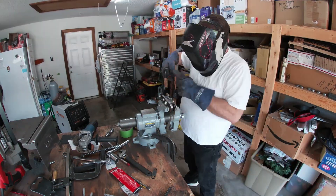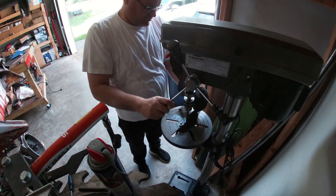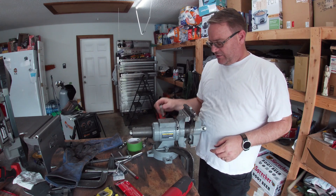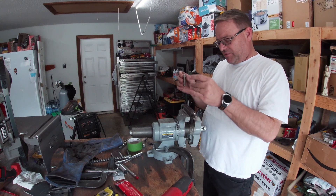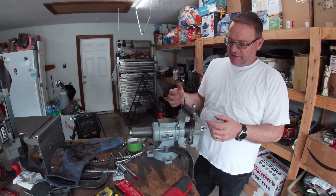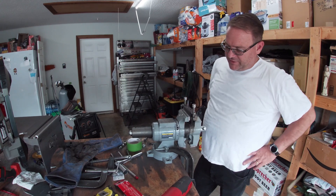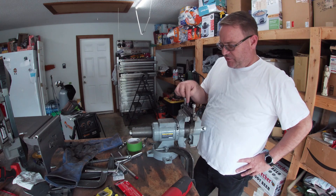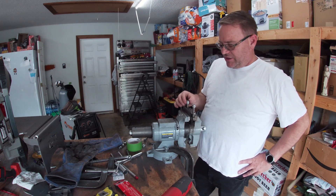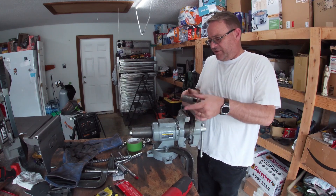While I wasn't happy with it I decided to keep going - it may just work. After welding them together, grinding them smooth, and chasing out the holes, there was a small issue. When I put this all together I dropped the bolts down through the middle holes and it took some pounding to get them in place. The problem is when I put them in the outside holes they almost line up - I should have put them in the outside holes first, not the inside holes, because that would have made the outside holes proper, which is the important part. I can chase the inside holes out but I can't chase the outside holes out because that's where the threads are.